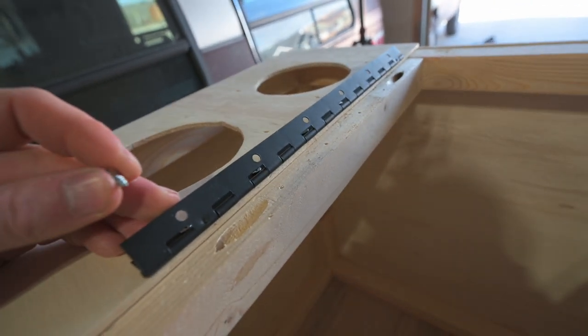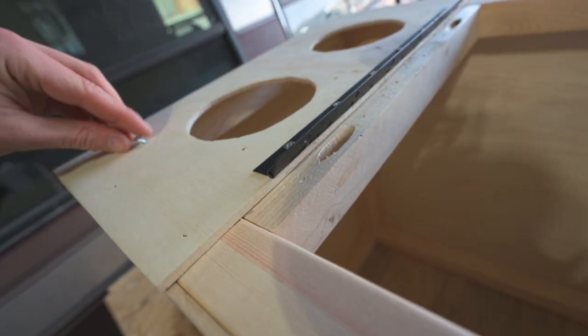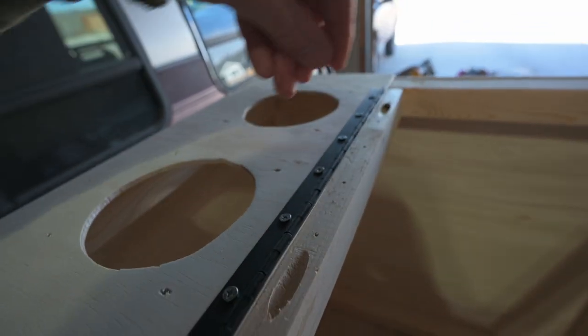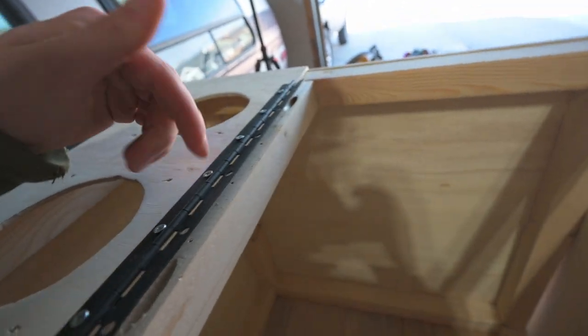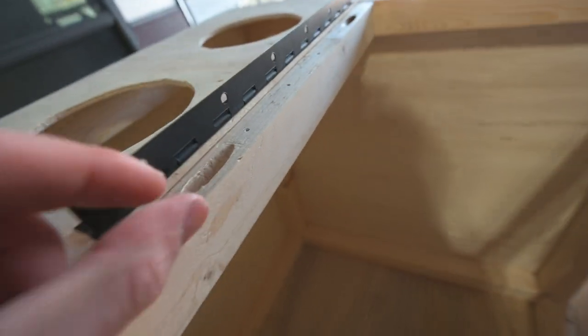When we were doing this we didn't quite think about the hinge — we have the hinge on this side but even using small half-inch screws they still go through the quarter-inch and into the cross support. We should have just moved that back. So we have a couple options: one, we screw it in but drill slightly bigger holes so the screws just sit in the holes; or two, we just glue it. We'll screw it, drill these holes out, and maybe grind it off if needed.